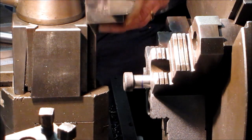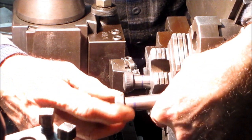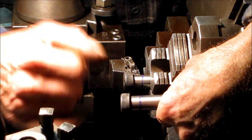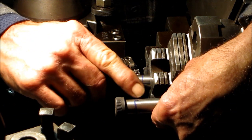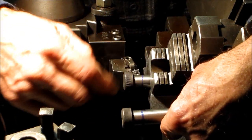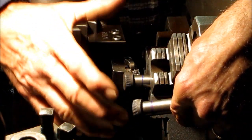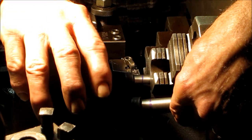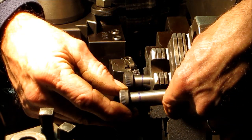We've got a series of shoulder bolts here and we put them in place on our jig that's going to hold that seat in — we kind of marked them for our plate thickness. Basically we're going to cut these back a half an inch, and we're going to take five thousandths off this diameter so we're sure we're getting clearance to go into the large bore before it goes into the slide section of our hole.